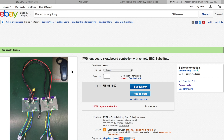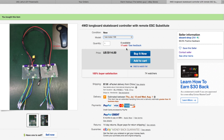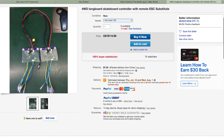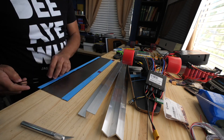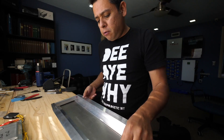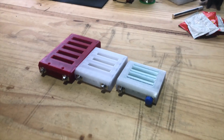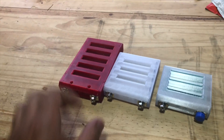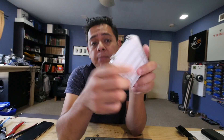Next, you're going to need speed controllers. I want to make this off-road skateboard all-wheel drive, so you're going to have to order something like this. To house the batteries, I want the deck to still be able to flex. In my earlier build I used a super stiff aluminum enclosure, but the problem is it makes the board really stiff and it loses all its flex, which makes it hard to ride on rough roads. So this time we are encasing the batteries using these 3D printed enclosures. These will hold the batteries and you will need 10 of them to make the 10S battery pack you need to run these 36-volt skateboards.